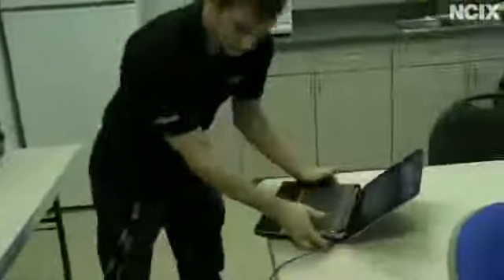Here we're going to transition over to a completely different circuit. I'm going to do two demos here. One of them is going to be to plug this notebook into a different circuit via Powerline and then show the streaming of a 720p HD video using Powerline. Once again, we are plugged directly into the wall. Powerline adapters are a lot better than they used to be in that they don't require the same amount of space around them because they don't kick off nearly so much heat. So there is our HD video streaming, and it would work even with the microwave plugged in because unlike wireless there isn't nearly the same degree of interference. You can see how quickly that worked — we're not cheating. As soon as I unplug the network, it does stop playing.